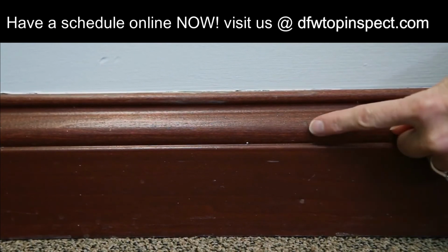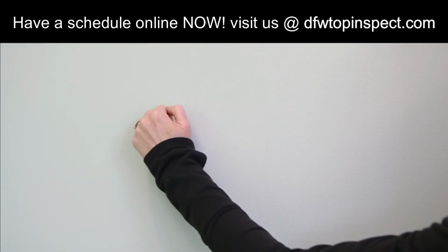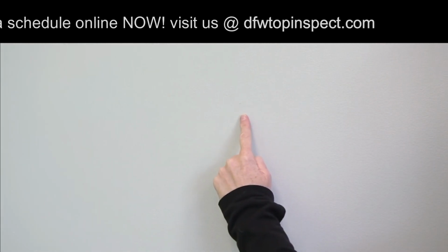There should be nail holes or spots that look like they may have been filled with wood filler in the same line. Another observation can be made by knocking on the wall. The sound will have a hollow tone where there is not a stud. As you knock over a stud, the sound will become more dense.